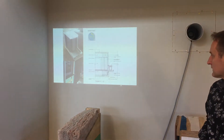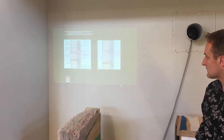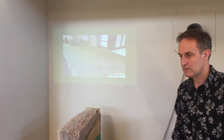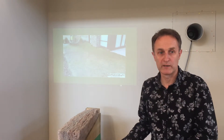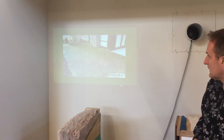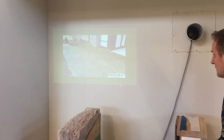80% of the heat is lost out of the edge of the slab, and until about two or three years ago nobody really talked about that in New Zealand — it's not part of the requirement for the code. Here's a photo from Max Raft, who do an insulated floor — a Queenstown-based company that sponsored our launch of the Super Home Movement down there on Wednesday.